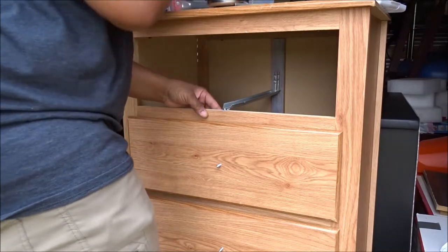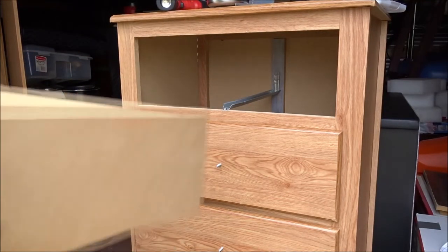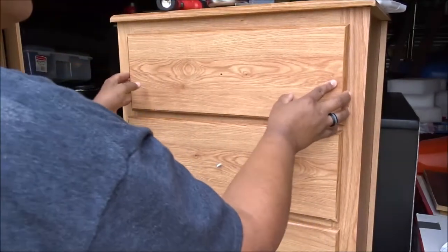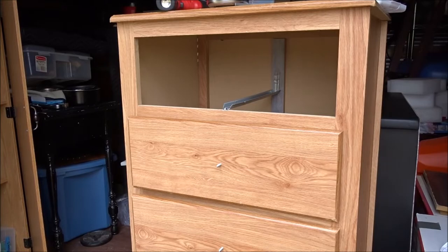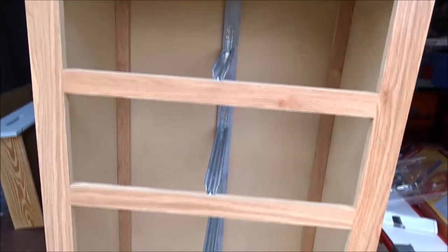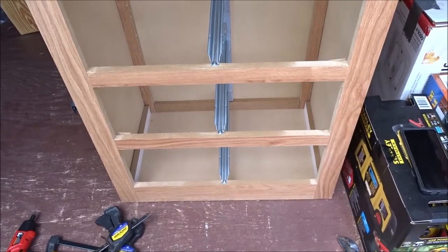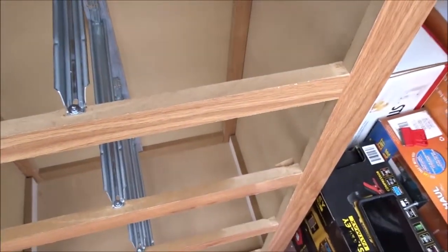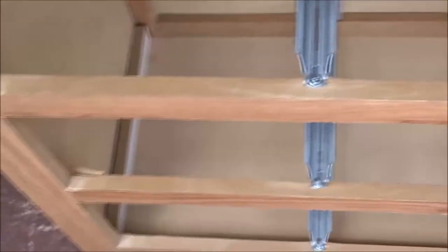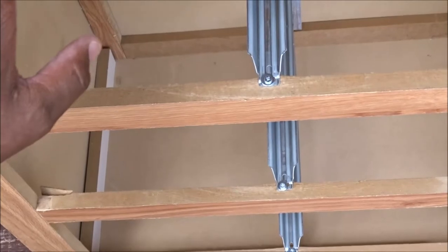Be careful — this stuff will strip very easily. Let's test fit this drawer. It fits good, looks good. Yes! This is going to work. I'm going to go ahead and fix all these. That worked so well. Got all of those in place, test fit the drawers, they look great. Everything is going very well. Now to continue on with the repairs — there's one spot where it's coming apart, and right there. I'm going to put some wet glue on there, clamp it, let that dry.